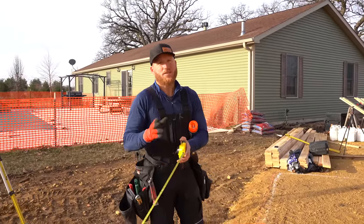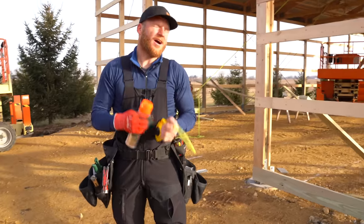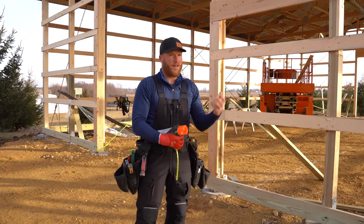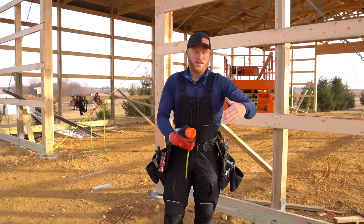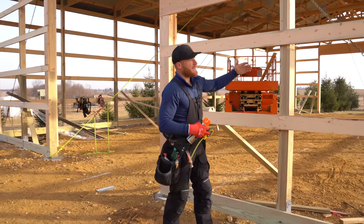And it's okay if the pier is just off center from your column or the column is not dead center on the pier. It ain't going anywhere, guys, I promise. Because of the layout of our ribs on the wall, we wanted this to all make sense and work from a water flashing standpoint. Instead of staying with the 8 foot spacing, these front porch columns are 8 foot, 4 1/2 inches apart. And the reason I did that, maybe it'll make sense later.